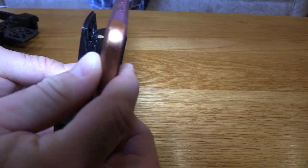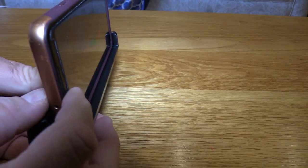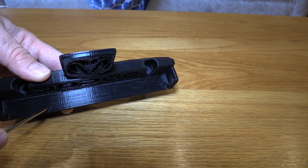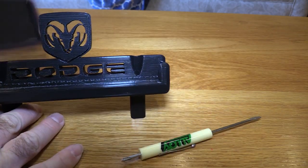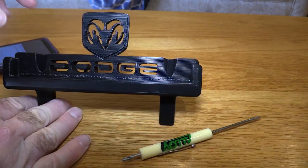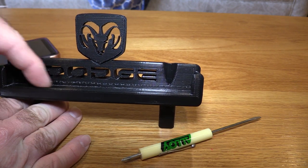With the old model you'll see there's this much play — it's still not bad — but with this new one there's a lot less play. The other thing I did was add a lip here, and that's for two reasons: there were some moments when this was new, before it shrunk, that the phone would pop out because the width was too great. This little lip keeps it from popping out, and it also means if you have a slightly smaller phone you could stick it on here.